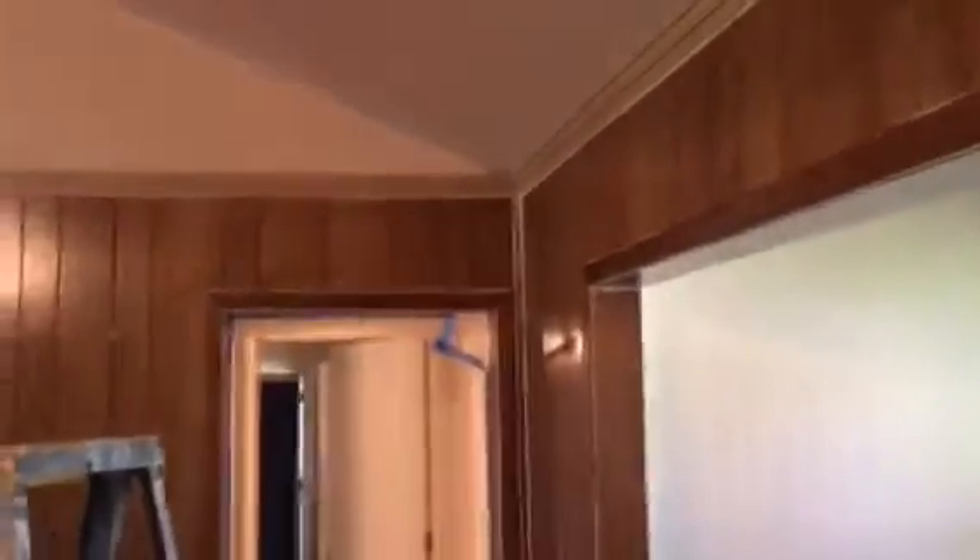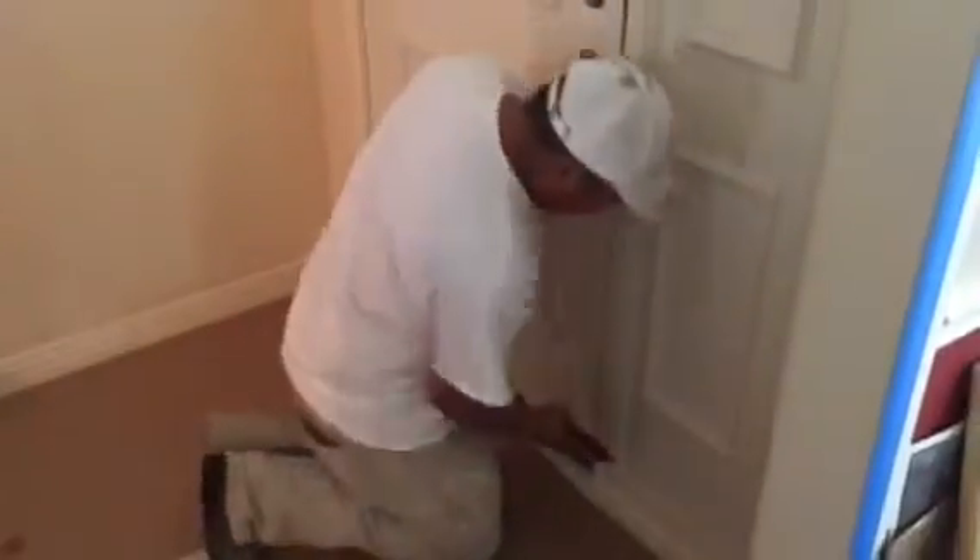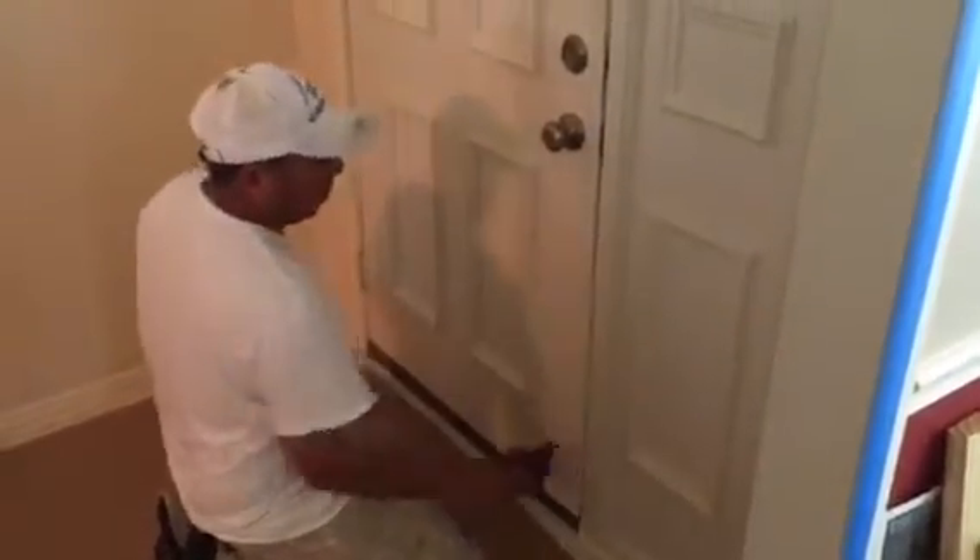Thank you for being patient with me. As I explained everything we're doing, you can see these walls are caulked in now — we're getting ready for primer. Over here you've got the champion of the world sanding down this front door. We always sand all the trim before we paint it. So here we are getting this door ready for paint. This door, the crown molding, and this base molding will all be white, and then these walls will be an off-white grayish color.